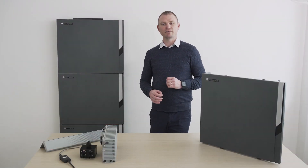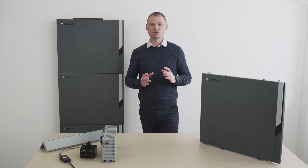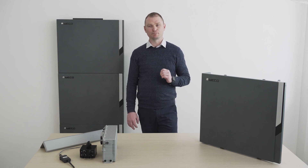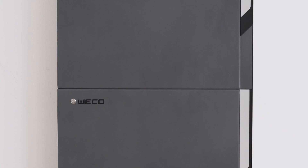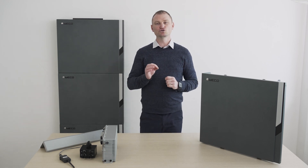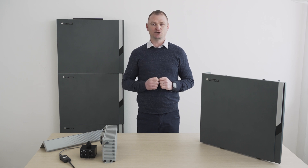The 4K5 Ultra is a battery module with a voltage of 51.2 volt DC that can be used directly as a low voltage storage system without any firmware changes or settings. The 4K5 Ultra battery module is equipped with Weco quick plug couplings for low voltage inverters — 44 to 58 volts — and up to 100 amps of charge and discharge current, and can be connected in parallel with up to 12 batteries without the need for external accessories. Note that the 4K5 Ultra battery is designed for low voltage use and therefore cannot be connected in series.